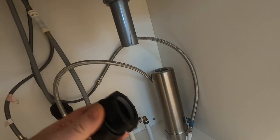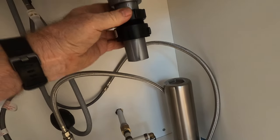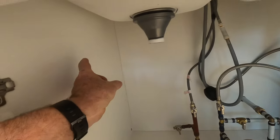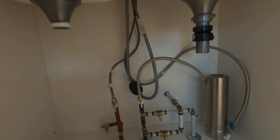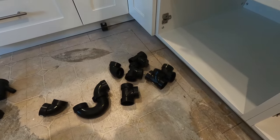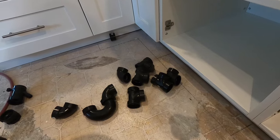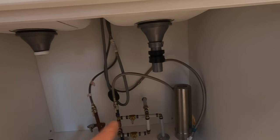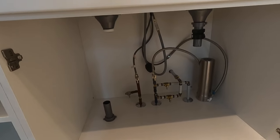Now is where we actually attach this to the drain in the home. There's this little device that slides on here, and that will clamp onto it — this is the start of our plumbing that will go down into the drain, where we start to glue it. All of our fittings are ABS — this black pipe. Where you are, you may have white PVC — that's just a local jurisdiction thing. Here we have to use ABS; that's what's required for our plumbing code. Also speaking of attention to detail — all these labels on the fittings, I like to remove those. I buy my stuff at Home Depot retail. I don't want to see all these labels when you open up the cabinet, so I remove all of them. I think it makes your job look cleaner and better.